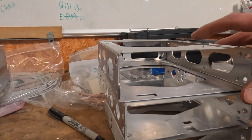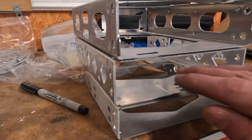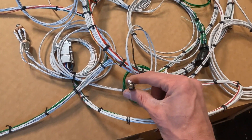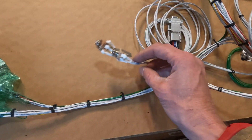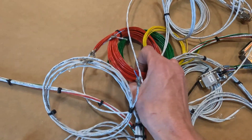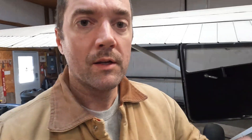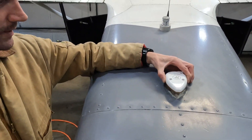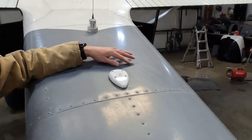Here are the mounts. The connectors are ready to go into the trays themselves. The harness is terminated everywhere — all the way down to audio in and headset plugs. All I need is powers and grounds and a couple of other connections. For the upgrade, I had to go to the WAAS antenna because I just had the cheap older Garmin non-WAAS aviation antenna. I already have the spot — this is where my Loran antenna used to live. Recently when I put the G5s in I used a block-off plate, and now I'm just putting the WAAS antenna on there.